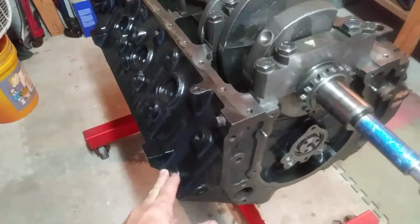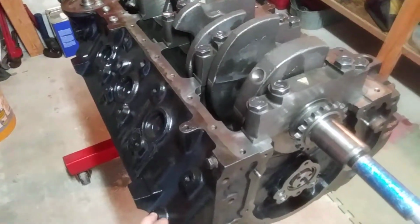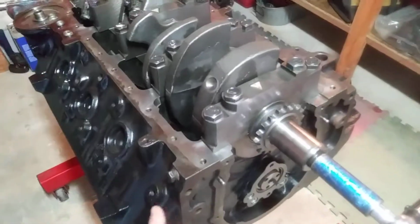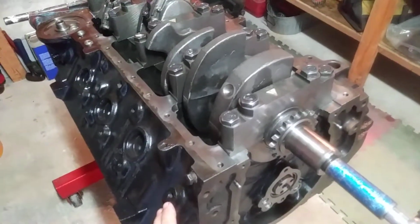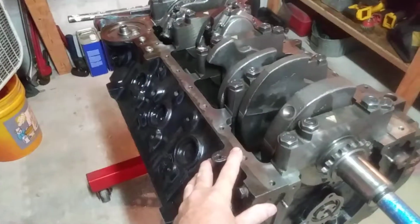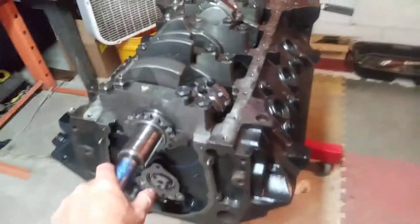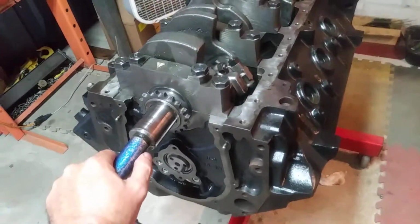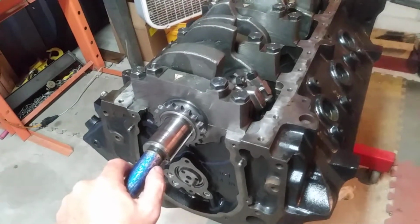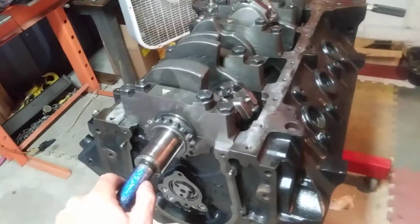configuration. And I'm looking at the Edelbrock Air Gap 7561 aluminum intake. This is a closed cooled system, even though it's a marine engine. We don't need the bronze ports at the waterway, so I'm okay with that. And then I'm probably going to encourage the client to go with a 1410 Edelbrock, which is a US Coast Guard approved carb. I like that carb.